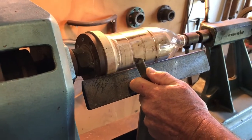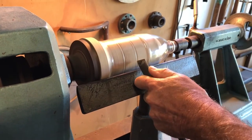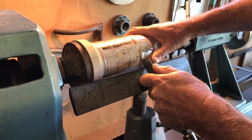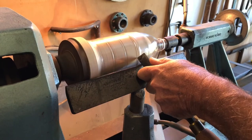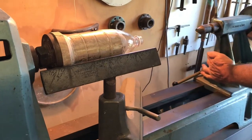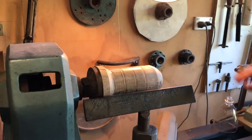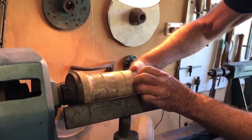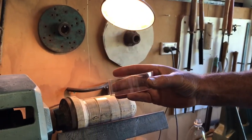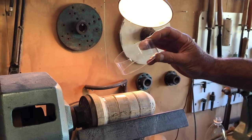As I go I may just need to tighten the tailstock slightly, and you can see it all occurs very, very quickly. I turn the machine off, loosen the tailstock off - the offcut that comes off is a nice little funnel shape - and then all the discs just slip off, giving a nice professional finish. I clean off the little texture mark, give it all a good wash and now it's ready to go.